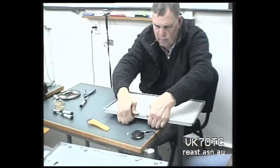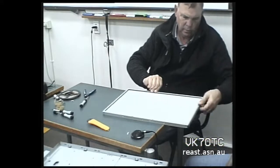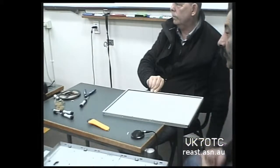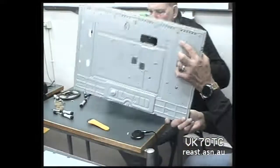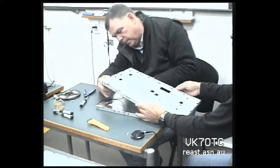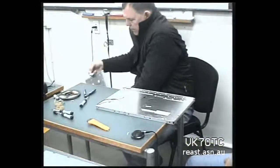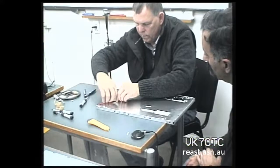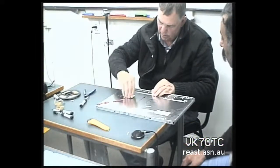They run off, I think it's 36 volts. The power supply puts out 36 volts. We have a question here from Harry: could you put a USB connection on the end, or does it have to have a power connector? USB is 5 volts. You probably could run them off 5 volts, but they'd be reasonably dark. But you could get LED strips that run off 5 volts and put them in its place. These are 12 volt LEDs, but you probably can get 5 volt LED strips.